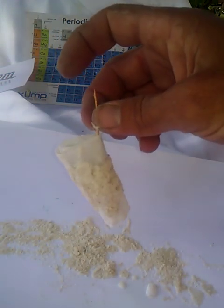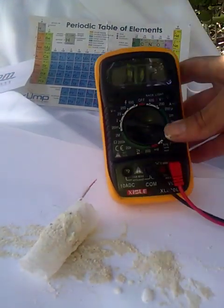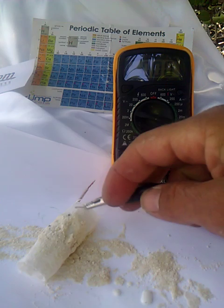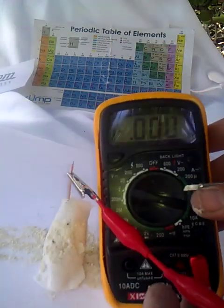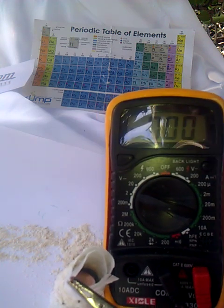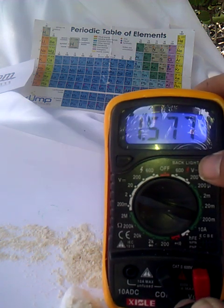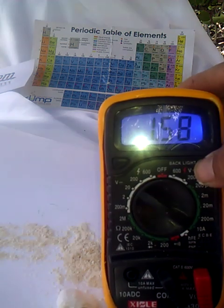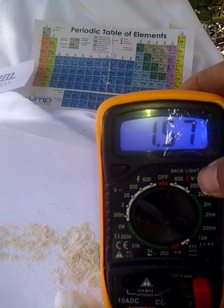Both sides are now coated. Now we're going to go ahead and see what voltage we get. We're on the 2-volt scale. Out here I have a small piece of magnesium strip, because we're going to put magnesium around here later on. I have the other end of the lead connected up here. I'll put the piece of magnesium touching the fiber — you guys can see that — 1.6 volts almost. Bringing it up to the 20-volt scale: 1.7, 1.57. She's holding steady at 1.57 — that's a constant steady voltage.